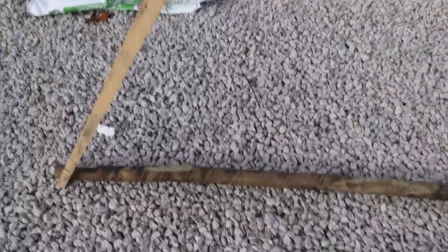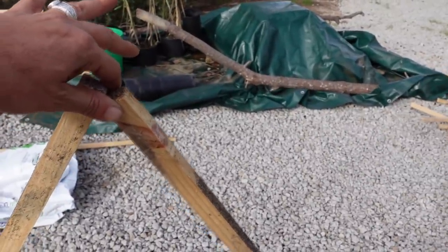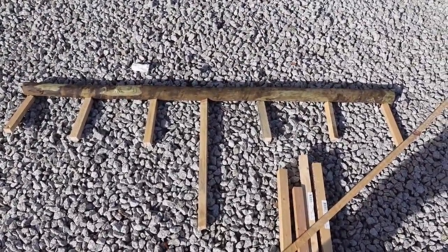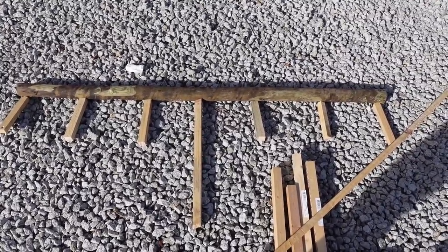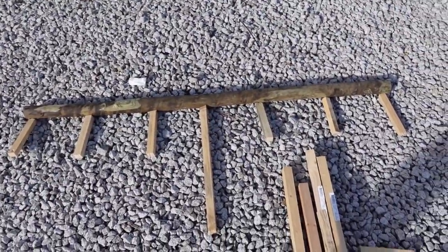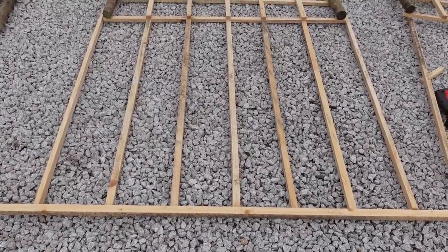There's my width, and there are two random-length poles — that's probably a little bit too tall. So I'm going to shorten them a bit and try again until I get an angle I'm happy with. That's the central beam of the top of the roof, and then the same sort of rough spacing as the sides — so that's six bits. I've spaced them out roughly, and these are just my templates. I need to cut myself 12 bits of wood the length of the template. That's the roof laid out on the floor.